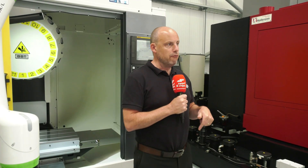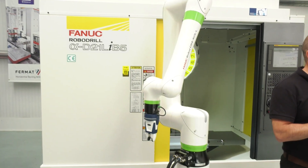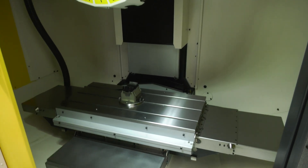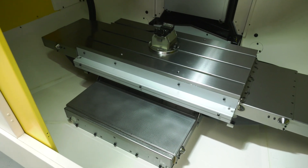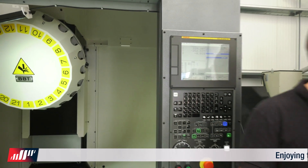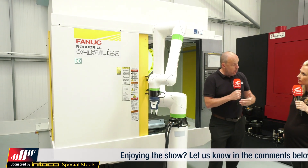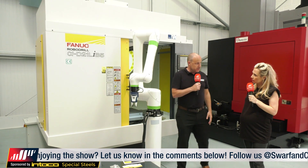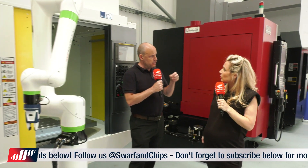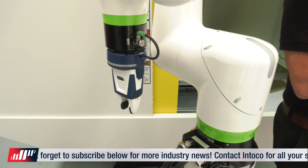The key point for me on this is the efficiency of the Robo Drill machines. This is about reducing the cost of your machine shop and reducing your overhead. With the cost of power going through the roof, machines like this can be 60 to 70 percent more efficient than BT40 machining centres, but they can still deliver very similar results when machining. This machine is very well aimed at job shops and production facilities. This particular machine is the long-bed FANUC Robo Drill, with almost as much working envelope as a traditional BT40 machining centre, a 21-station tool changer, and 0.7 to 0.9 chip-to-chip on the tool changes — very quick, reducing cycle times.